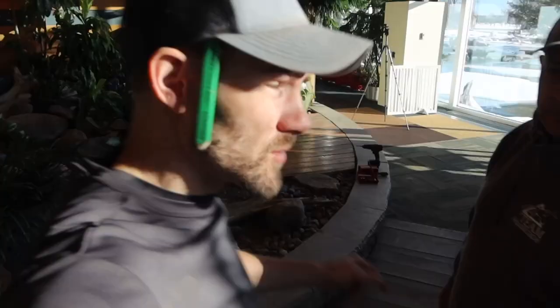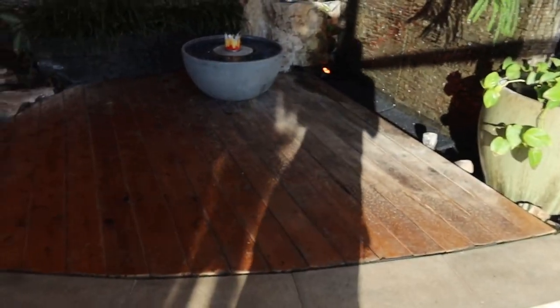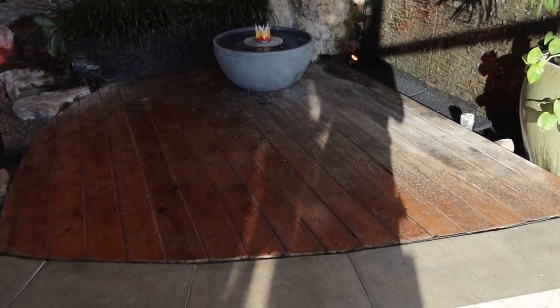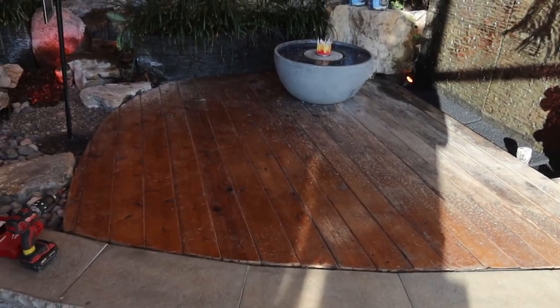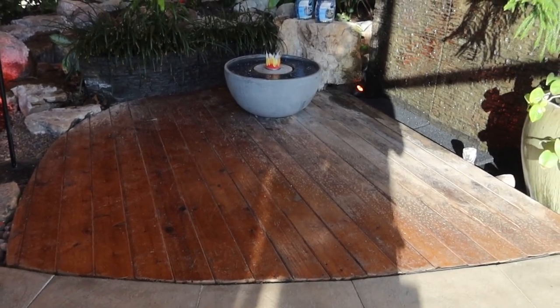As Chris was saying, Luis and I are done with the patio. We're now gonna jump over here to the deck. So the plan is to come over here. We're gonna take all of this old wood decking out that's discolored. We're gonna replace that with some brand new Trex decking. I believe a gray composite color. So plan is we're gonna jump in on this. We're gonna zip all these off, lay those down on our new wood, trim it all out, cut it out to fit, and we are gonna start putting in the new deck with the hidden screw fastener components so that it'll be a nice, clean, traditional look. You ready to do it? Yep. Good work.